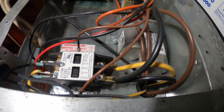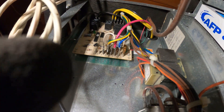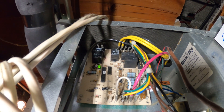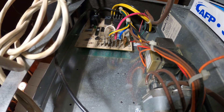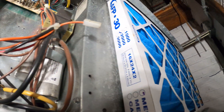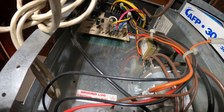Let's see if there's a five-minute delay. All right, we got a contactor, two run capacitors, a transformer, and some sort of control board. I got a green light on there — I'm not sure what that means. I don't even know what kind of unit this is; the panels are missing. The filter is definitely brand new. Let's give it a few minutes and see what's going on.